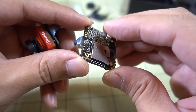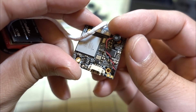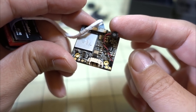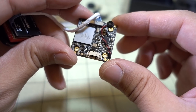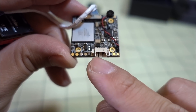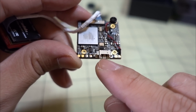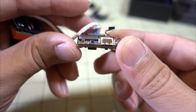Still one-button operation, and now they've added a microphone — that was really missing before. We'll have to see what the audio quality is like, since on the Split Mini the audio was terrible so most people just turned it off. We'll see if this is any good. They also added some solder points here — these four solder points correspond to four pins for power, ground, video, and I believe the OSD joystick as well. So you have the option to do a direct solder or use the plug.